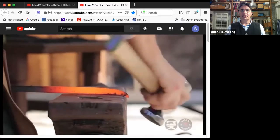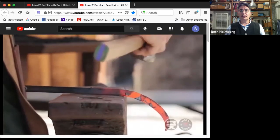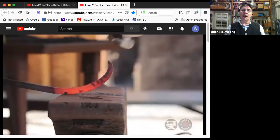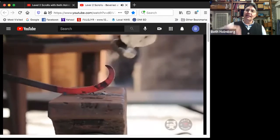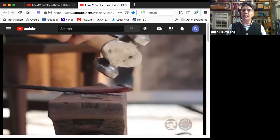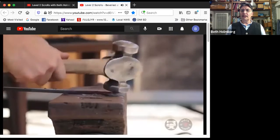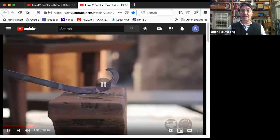Barely at the edge, starting to scroll down, feeding it slowly at first, then faster, faster, faster. Nice. I'm going to make sure that it's actually flat so things will work out physics-wise. And again, I'm going to focus on the first half a turn, getting that tip around into a really nice shape, inside and out. I want both of those looking really good. All right, moving the bend down a little bit, making it flat. That's actually it. That is the end of this step.